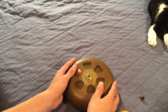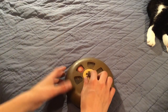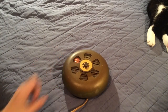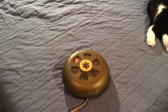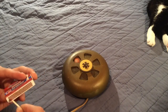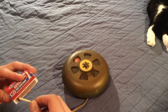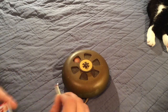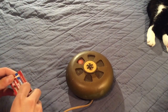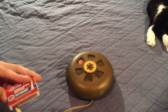So now I'll replace the cover. I'm gonna test it for you. I tested it right before I started this video, and it has a very unusual sound — you just gotta hear it. I'm gonna get my matches, because obviously this smoke detector does not have a test button, as it was made way before those were put in. And because this smoke detector is photoelectric, it senses more slow smoky fire, so I'm gonna light the match and blow it right out, which will create a lot of good smoke for it to sense. Well, that wasn't a lot of smoke. Hang on, let me try this again.